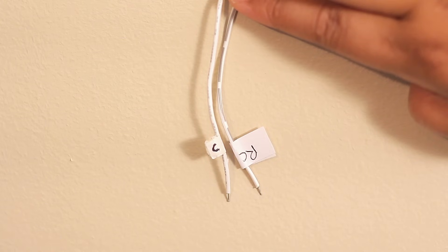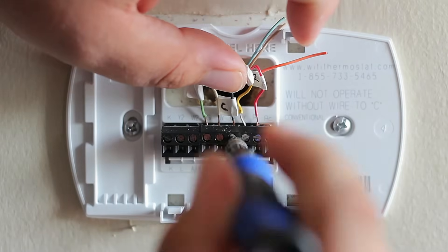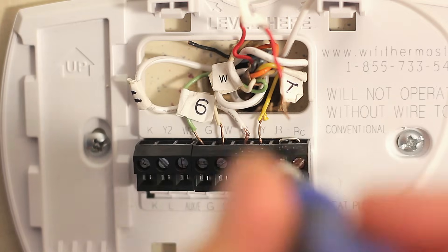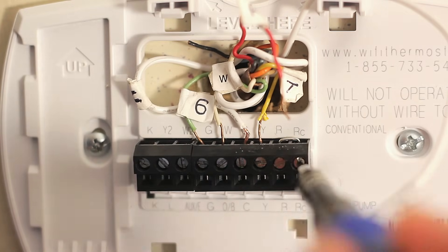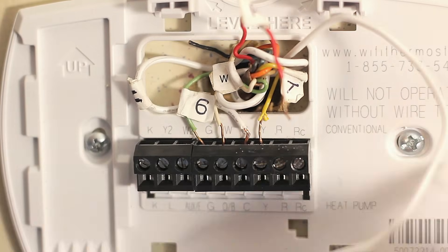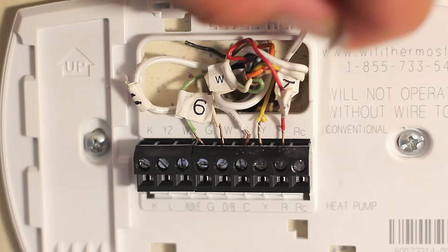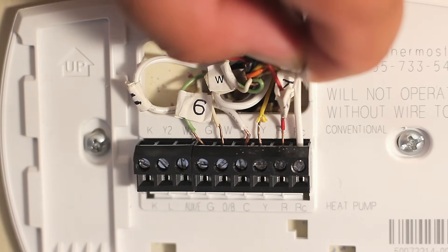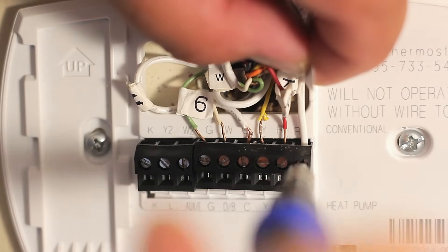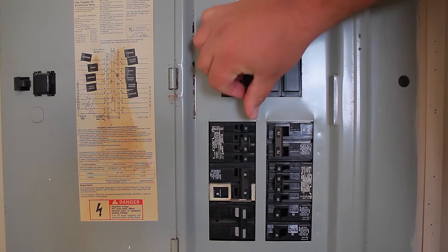Once you've run the cable, you'll need some plaster or white cement to cover the hole in your wall. Now label each wire — according to the manual, it doesn't matter which is which, as long as you connect one wire to the C and another to the RC. If you're using this adapter method, you won't need the jumper. The jumper is used when you have an R but not an RC. If you have both R and RC cables, you don't need the jumper. Always verify with your manual for your particular system.